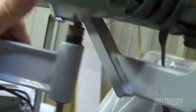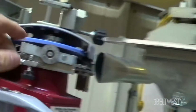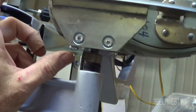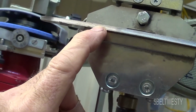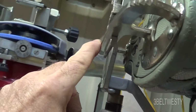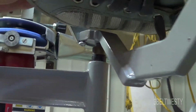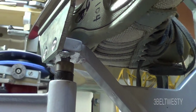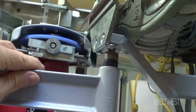But over here, that's what I was running into. I was going to adjust the little wheel here on the SSM2 higher, and I found out that it was sharpening up here in the top, but not the bottom. So I said, oh, I got the Z height screwed up, and was all ready to start to adjust the wheel up. Then I noticed that, oh my God, this is the little bitty one that runs through and tends to touch something up there. So now that's free, so I'm good to go.